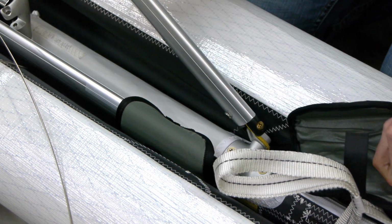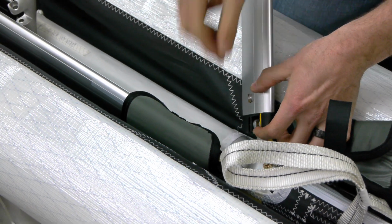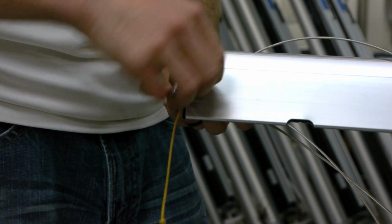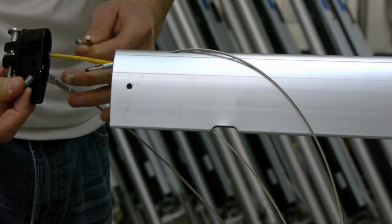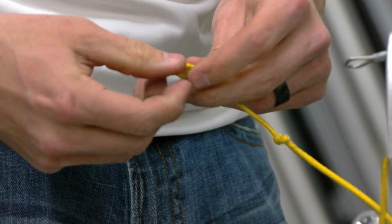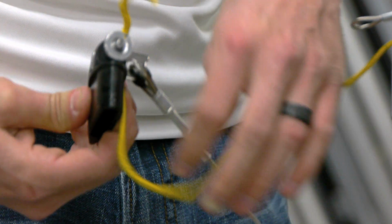Next, you'll want to remove the end plugs from the top and bottom of the broken down tube by removing the pin and safety ring that hold them in. Remove the small bushing retaining the VG system and front and rear wires in the bottom plug. Untie the knots in the lower VG rope and remove the rope from the lower down tube plug.